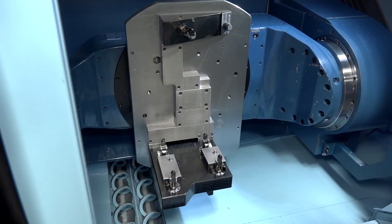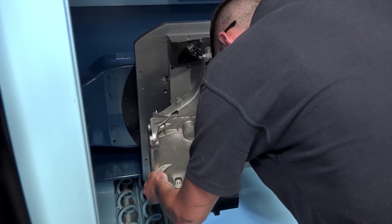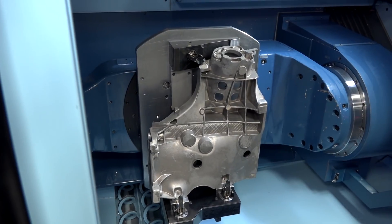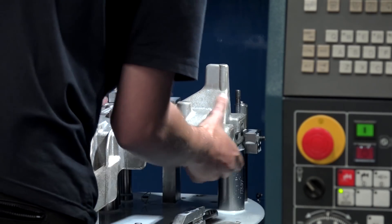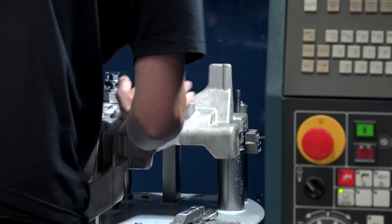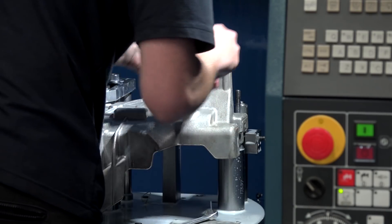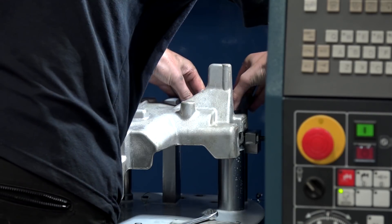And with doing this type of machining on these castings, I don't think it'd be wrong to say it's not a very complicated machining process, is it? But what are the factors involved when you're making and machining castings like this? What do you have to consider on the machine? Well, it's all down to the machine envelope. It's about what the process needs from us, so that may be different tooling, workholding. We take all that into consideration when we choose the machine and when we spec the piece of kit for what we're looking for.